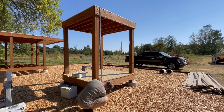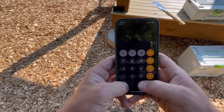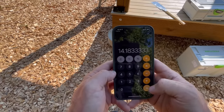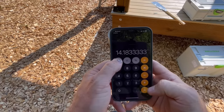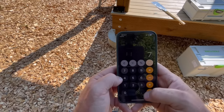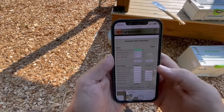Next, we had to figure out all the math for the stairs. You can take the total height — ours was 106.375 inches — and divide it by 7.5, a good rise height per step, which gave us 14.183. You can play around with the numbers to find a good divisor, making sure your rise stays between 6 and 8 inches — otherwise it's going to get funky.